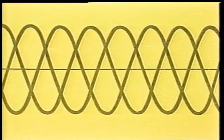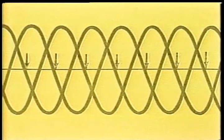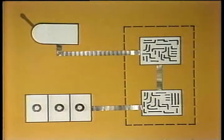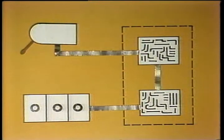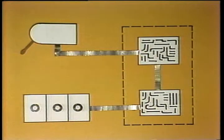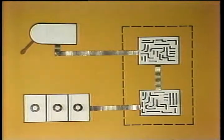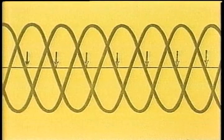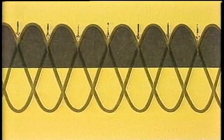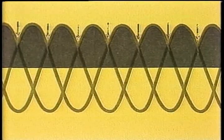With the driller's control off, the SCRs are theoretically gated at the end of the positive half cycle, so there's no output. As the driller's control is moved toward full on, the throttle signal increases toward a maximum of about 12 volts, causing the control voltage to drop toward a minimum of 1/2 volt. This tells the firing circuit to gate the SCRs earlier and earlier in each cycle, resulting in more DC output to the brake coils.